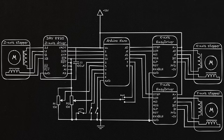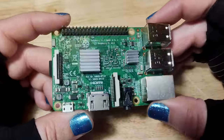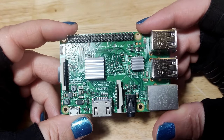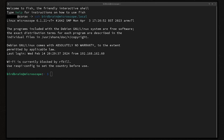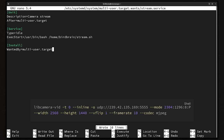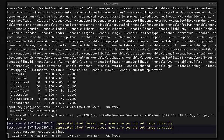I also alluded to adding a 2K digital camera, and for that purpose I got myself a Raspberry Pi Cam 3, which I drive through a Raspberry Pi. The Raspberry Pi also serves to broadcast the image on the local network, so that it would be possible to tune in from my PC. To do that, I first installed Raspbian on an SD card, then made a systemd unit to run the camera command after booting. So now, as long as the microscope and my PC are on the same local network, I can run a command in a terminal on my PC and it will open up the video stream from the camera.